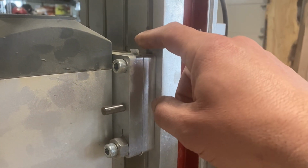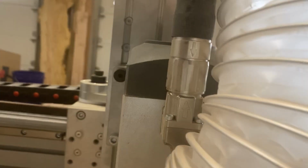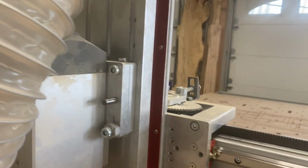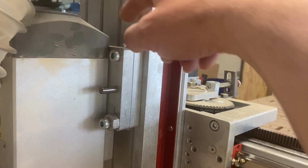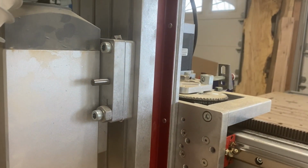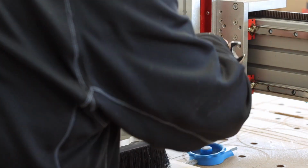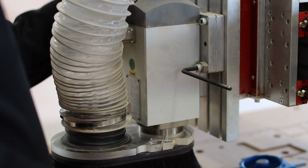And in this case, you can see tin foil at the top and tin foil at the bottom on both sides of my CNC head. That's because from the factory it did not come perfectly trammed. And these are folded in matching depths on both the top and the bottom. Here I've loosened those 4 hex bolts and removed that set pin, and now I'm making my first attempt at an adjustment that will get the x-axis in tram.